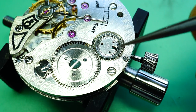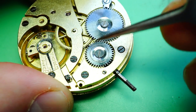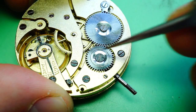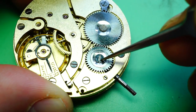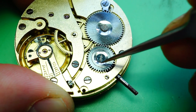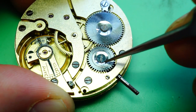The reason why the winding pinion is slipping is because of this design. To explain it more easily: on nearly all traditional Swiss made watches, thousands of calibres share the same design feature. This is the ratchet wheel where the mainspring sits, and this is the crown wheel for the winding mechanism. The keyless works come in here and wind through here onto the ratchet wheel. The crown wheel and ratchet wheel are secured by a single screw, which allows the crown wheel to move via a single shim. This is a tried and trusted method that allows the crown wheel to move freely whilst reducing play.